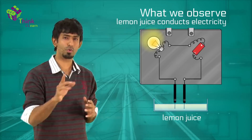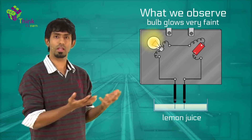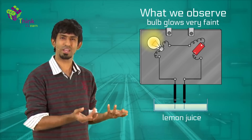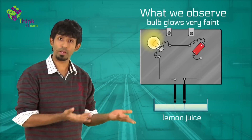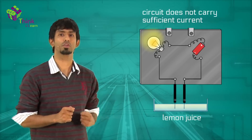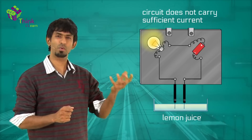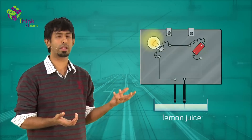You might not have noticed, but the bulb is glowing very faintly — it's not really proper conduction, it's very poor. You're a little worried because something might be a decently good conductor, but the bulb still may not glow because enough current is not flowing. The bulb itself requires a lot of current, so passing it through a liquid like this might not give us a good idea.